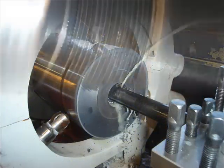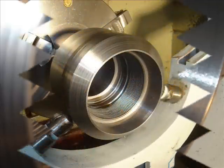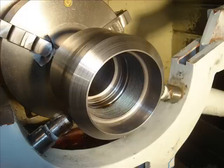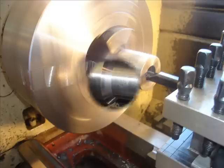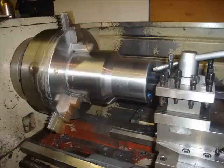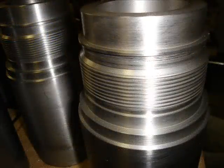I had to drill through and bore it, open it up, cut an ACME thread near this 4 and a half inch ID, put a chamfer on it, and here I'm boring the other end. There's the external ACME thread for it with the O-ring seals and the groove seals.